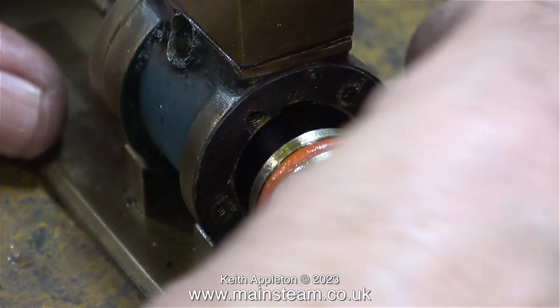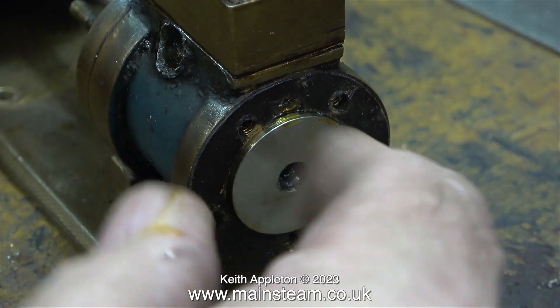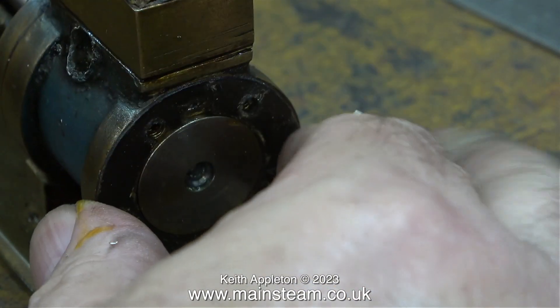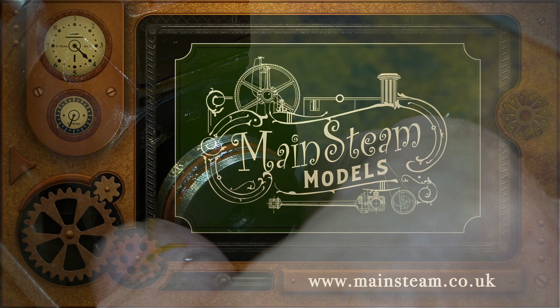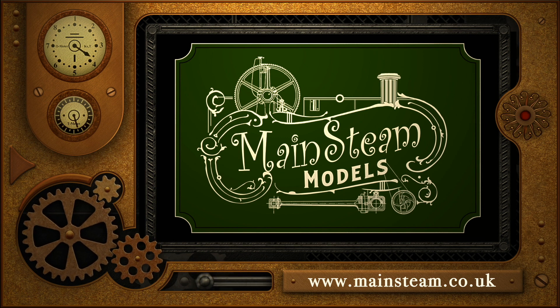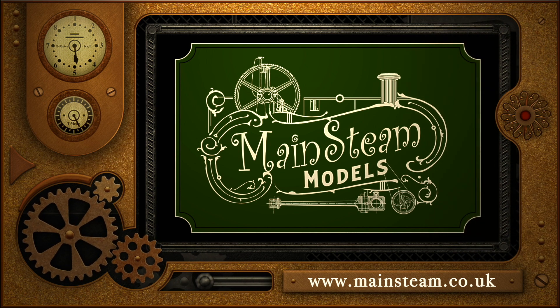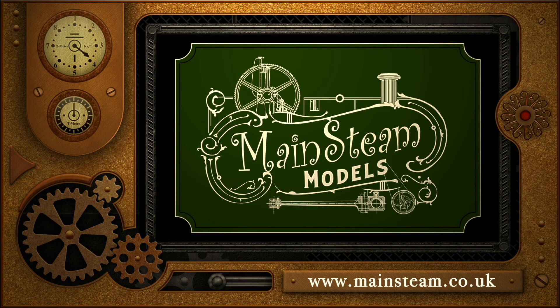Before fitting the piston ring I'm using some emery cloth to remove the sharp edges on the groove as well as around the outside. And here we have it — one fairly badly made piston to fit in a very badly made cylinder. Fitting the silicone O-ring: the first thing to do is to absolutely fill the groove with steam oil. Somewhat miraculously the piston and rod are a perfect fit in the cylinder. This episode has covered a very important part of this rebuild. That's it for now — stay safe, stay healthy, thanks for watching and I hope you found it useful. Please visit my main steam models website and click on the video playlists section to find other videos and watch them back to back.